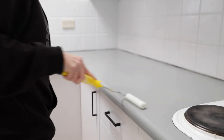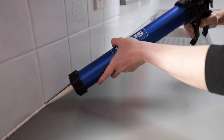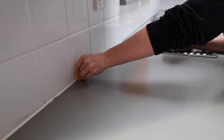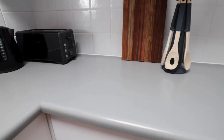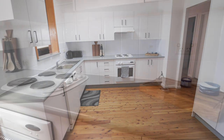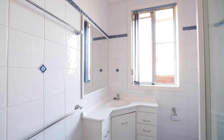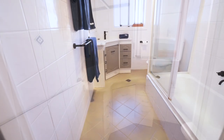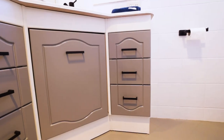The last coat of clear could be applied, and when dried I came back through with some white waterproof silicone to really round out the project. I applied a bead of silicone and then used a silicone tool to smooth it over. The last step was to dress the kitchen with some decor and sit back and enjoy the finished product. The bench top is recommended not to be touched for seven days, so we made sure to be very careful. I'm sure you're wondering about the longevity of this renovation range — the honest answer is I don't know, but I will come back and check in with the owners. For three days' work and a thousand dollars, I would say that's money well spent. I'll include some before and afters of the bathroom at the end — it also came up great. I hope you liked this video, and if you did, please hit those subscribe and like buttons — I'll see you on the next one.